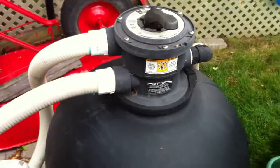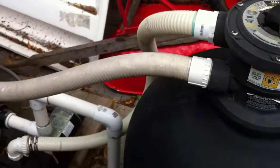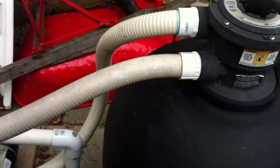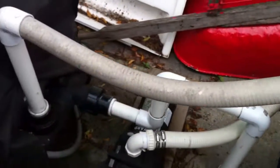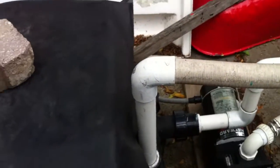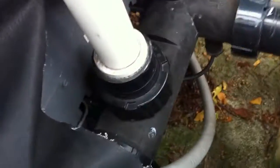From the top side of the pump we come up into the filter. This filter is a 300-pound filter tank. This pool I'm dealing with here is the equivalent of a 20 by 40 humpback kidney, so it's a pretty big pool. This filter is probably just barely large enough for the pool.